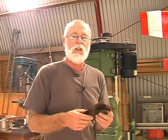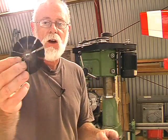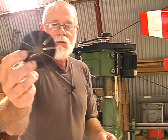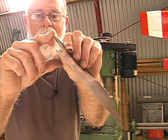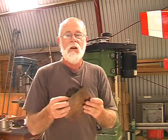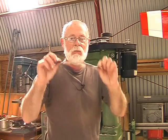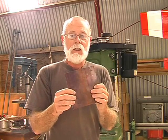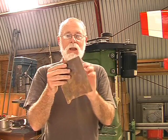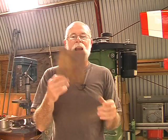As anyone who builds valved pulse jet engines will tell you, one of the hardest things to do is to build a good reed valve. This is a petal valve out of a model size pulse jet engine. It consists of a whole lot of little petals and some gaps. These petals, when the air pressure inside the engine changes, can flex backwards and forwards, allowing fresh air to come in but stopping the hot exhaust gases from rushing out when the engine fires. Making such a valve can be quite difficult because you can't just take a piece of spring steel and cut around it with your snips or shears, because what will happen is that it will crack, bend and twist, and when you've finally got your valve out of the sheet of metal it will be all bent and distorted and will not work.